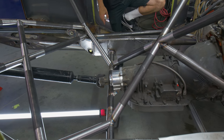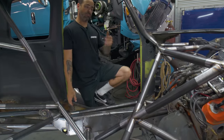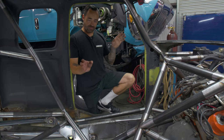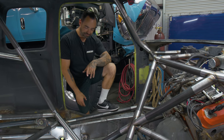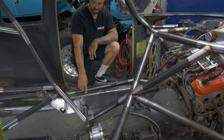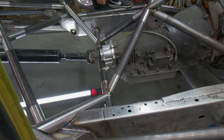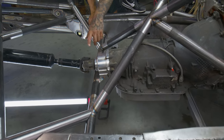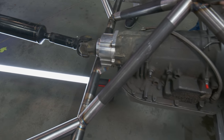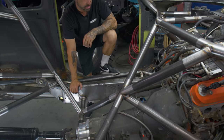We did retain the original engine mounts, which are just your standardized 4-bolt block mounts on the side. This is not a mid-plate vehicle or a front plate vehicle or anything like that. So just retaining some of the original stuff there with the trans mount, we just simplified it. It's now part of the structure and just the middle portion drops out via tube connectors. You can see you just undo these guys. Tube connectors are our friend here. Undo these guys and this guy will come out. This whole packaging portion is kind of the core of the vehicle, and we'll get into that in a second.